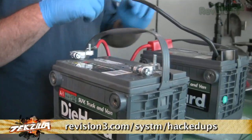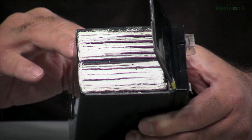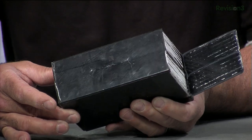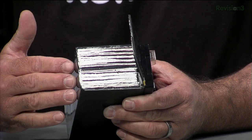I don't like putting car batteries on uninterruptible power supplies — we did an episode about that. Here's what happens to a battery that has not been properly charged. This is a standard APC battery that was run long past its life cycle. You can see the cracks in the case — this was not dropped. It actually expanded so much after being left in storage and the battery went bad.